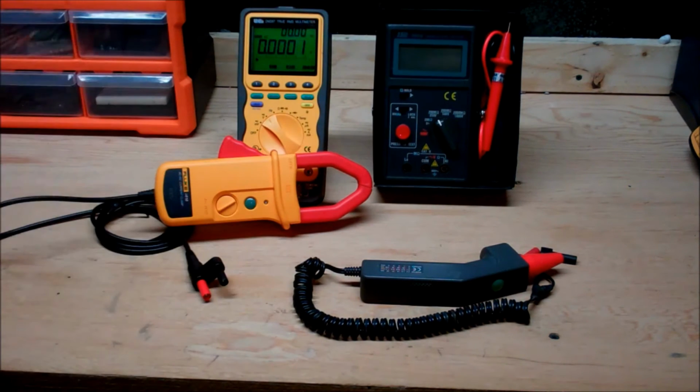The insulation tester is a tool I'm really eager to test out at work, determining the insulation qualities of all my new installations and all that stuff. It's going to be really nice. I usually did that with a multimeter, but now I know I have a really good way of testing, because now I can hit those high voltages as well as establish if it's in the megaohms, where my multimeter won't be able to reach.